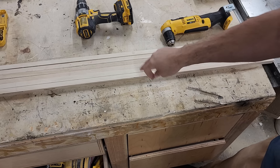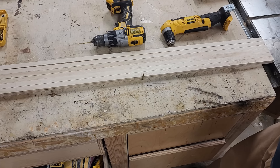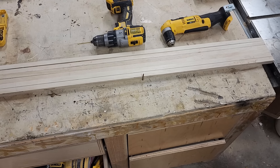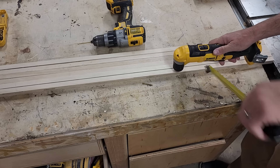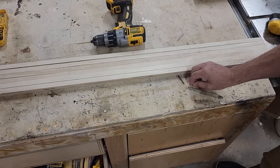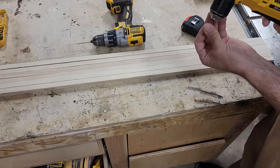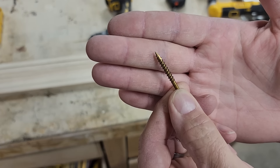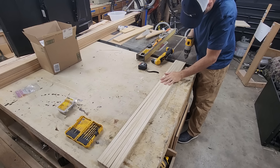This is the screw that's going to attach this to the top of the cabinet. I'm going to pre-drill with a one-eighth inch drill bit, and when I go to screw this to the top of the cabinet I will have six inches. Got my 90-degree angle drill and we are five inches with a little bit of room for the bit — that'll be perfect. We'll just be able to fit this with a bit in here sunk all the way in and send these screws into the top. It does have a nice self-drilling tip so that you won't split the face frames.